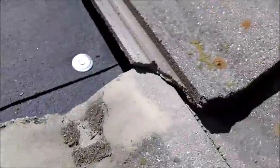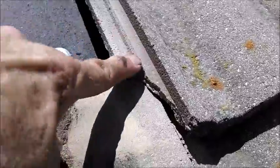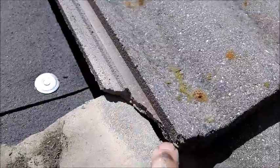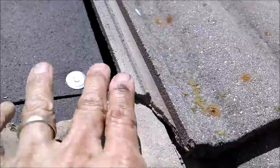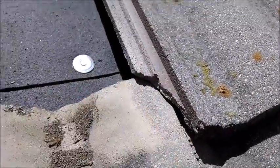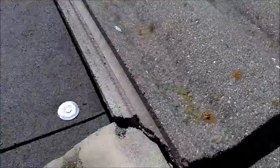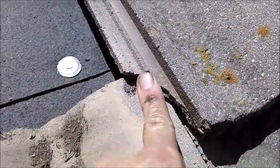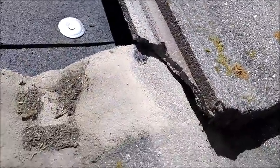Here's another crack - a chip corner on the underside of the side lap on this tile. Water running down this groove has the potential of getting in there. This chip corner is a little too close to the top and can potentially get through in a driving rain even with the next tile covering it. So what I'll do is put some sealant right in there underneath this tile, then take my finger and feather the edge - that water will never get back up that way even in a driving rain. That's how I do it.